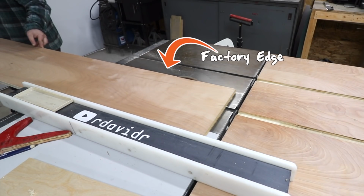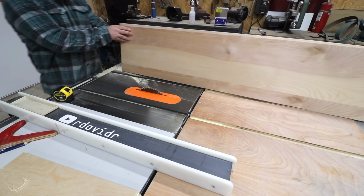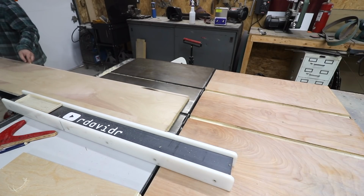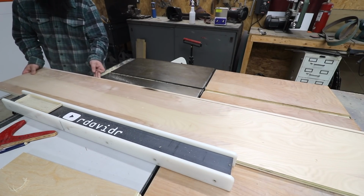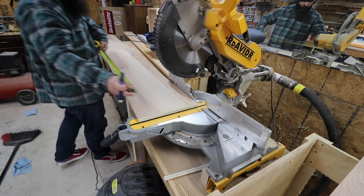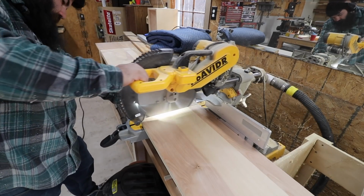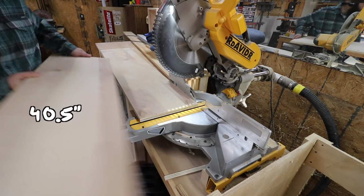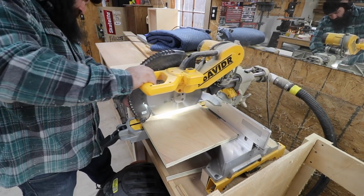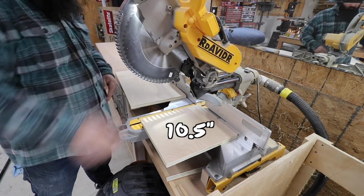This piece has the factory edge on it, so I like to rip that off just because usually it's a bit rough, but then I'll flip the piece and cut it to width, which in my case is 12¼ inches. And later on, I'll be adding a face frame, which will make it 13 inches total. Then over on this totally factory original chop saw, I'll cut the top to size, which is 40½ inches, and then the 3 uprights, which will be 10½ inches tall for the rack spaces. And this hutch isn't too complicated, but I will have a cut list listed down in the description.